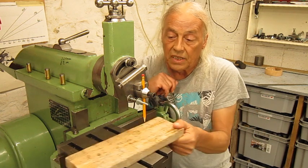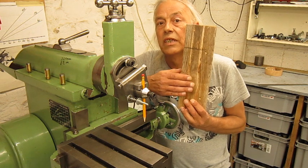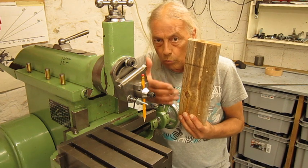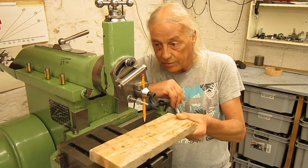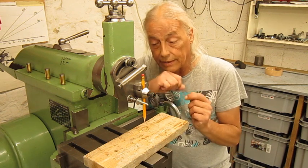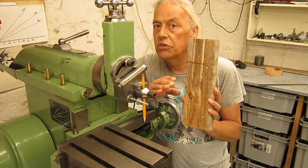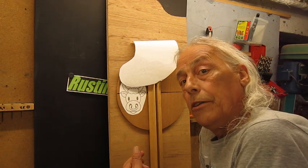That's possible. The problem is, of course, if the underside — this side of the part — is not machined, we're going to lose all precision. And I think precision is important. If you have a part like this, whatever model or form, and one side is machined, then indeed you can put it on the table, clamp it down, do one cut, take the clamps off, move your part, and do the second cut — that will be precise. But if this side is not machined, you will lose all precision. To be a little bit more complete: